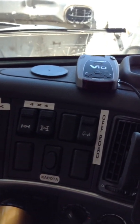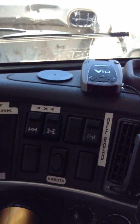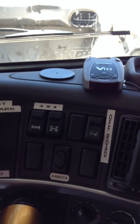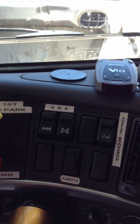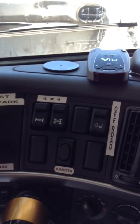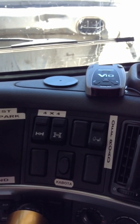You can then engage it, accelerate and decelerate a little bit, possibly maneuver just a little bit left to right to let the gears line up and engage. You can operate that at highway speed — slow highway speeds, let's say 55 miles an hour or less.